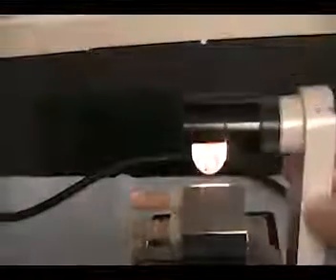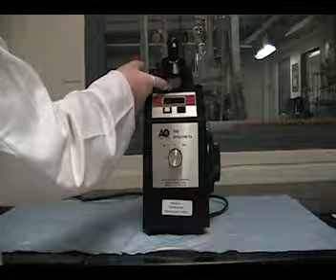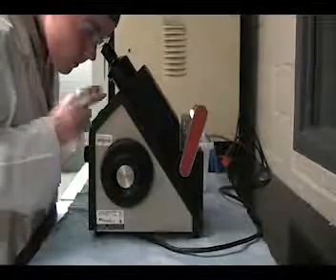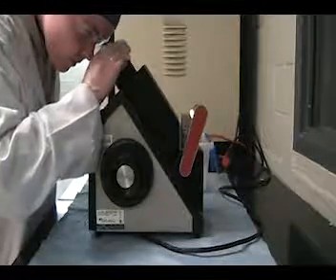Close the prism cover and position the illumination arm above the prism cover so that light may pass through the glass prisms and the solution between them. Next, place the crosshair adjustment access hole at the 6 o'clock position by adjusting the dispersion correction wheel. Looking into the eyepiece, rotate the eyepiece to bring the crosshair into focus.